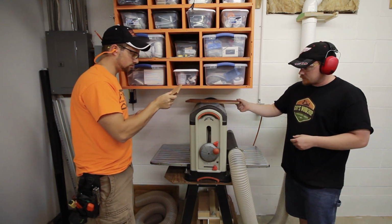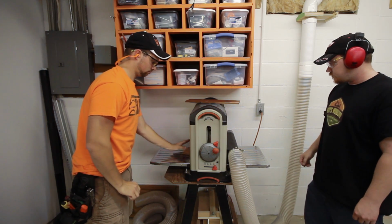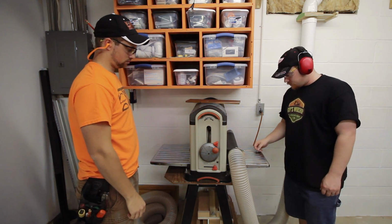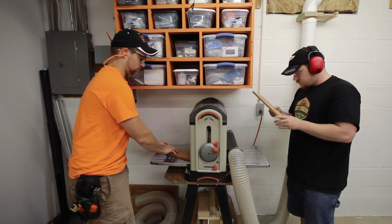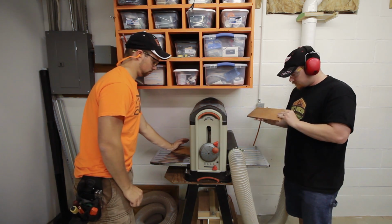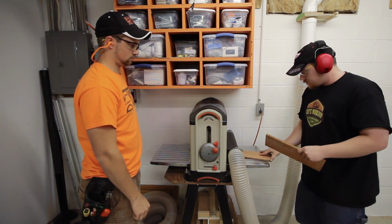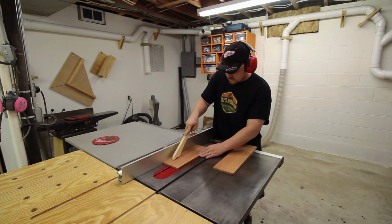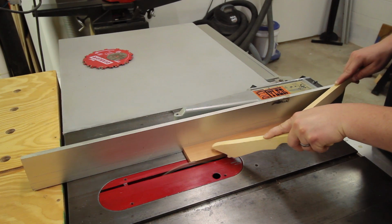After the bandsaw, we went to the planer to not only remove the bandsaw marks, but also determine the final thickness of our material. I think the exact thickness ended up being just shy of a half of an inch. But it's not too important regardless though, because we were just trying to maximize the material size from the board we had. Then over to the table saw, the final width was established.